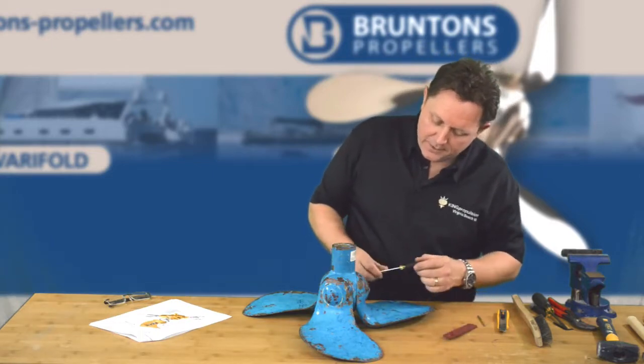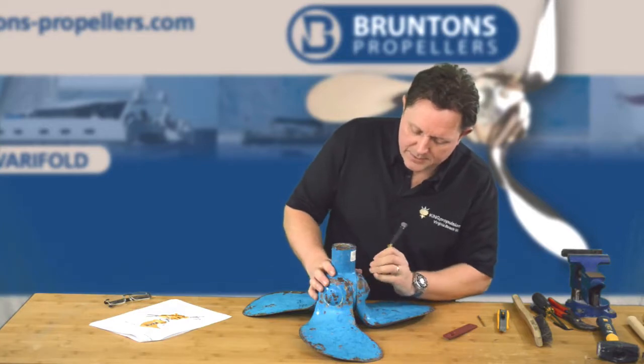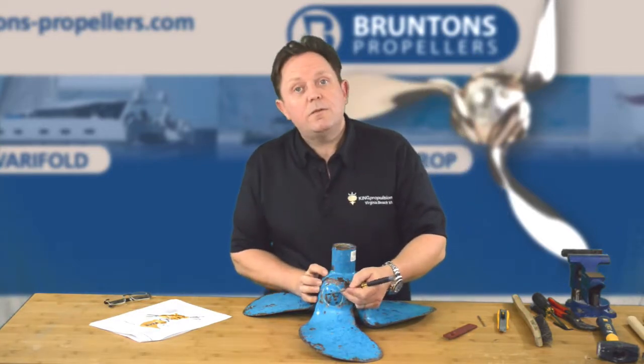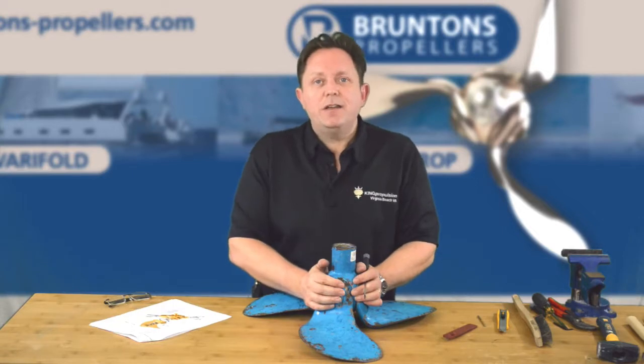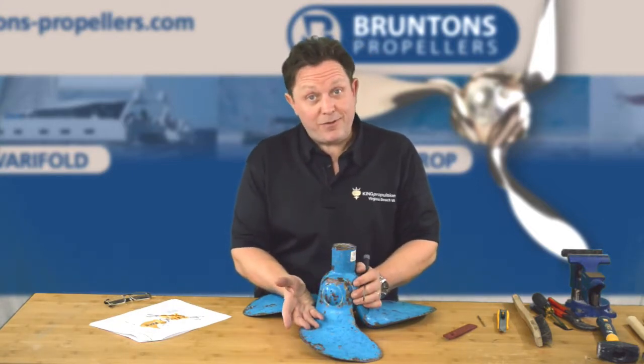I'm going to go ahead now and clean all these channels out and see if we can start to break some of these caps off. So once we break the cap off on this one here, underneath we should start seeing all the roller bearings and the real insides of the propeller. And from that we can see straight away how much grease is inside, what the color of the grease is like, what the quality of the grease is.